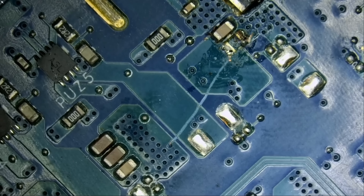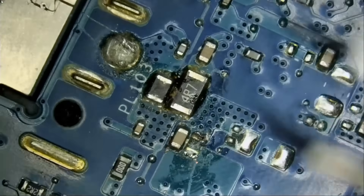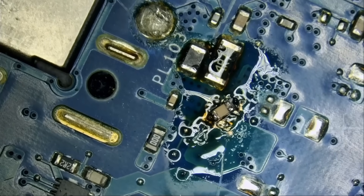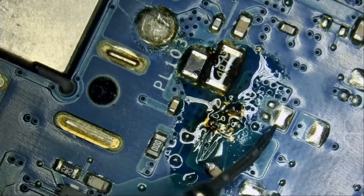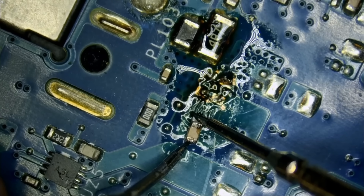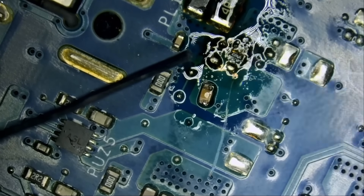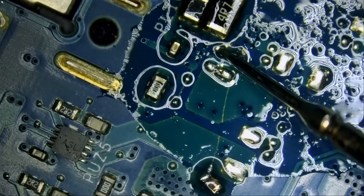What is the value of that cap? We can desolder a nearby one, measure it, and grab a similar cap. Using my LCR meter, I'm reading 104 nanofarads, so essentially 100 nanofarads — with a 10 or 20 percent tolerance, it doesn't matter. Those two capacitors are connecting in parallel — this pad connects with this, and this connects with this.